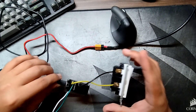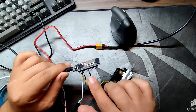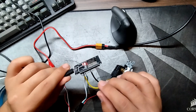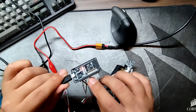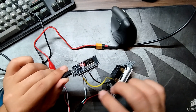Basically what you need to do is get your ESP32 module and use D5 as your GPIO pin. You have two cables coming from the switch — one goes to D5 (or any other available pin) and the other goes to ground.